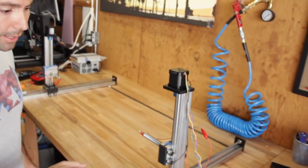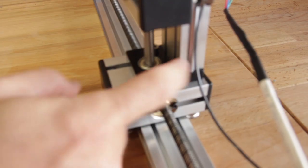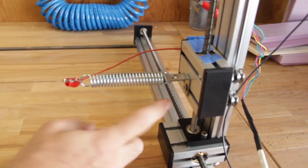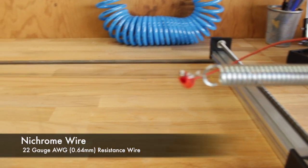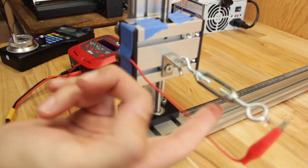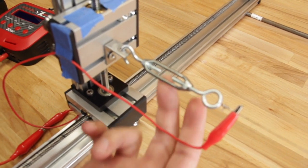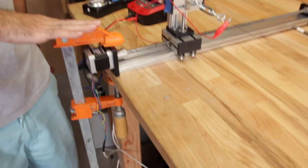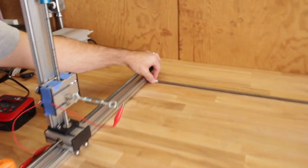All four of these cost me around 300 to 310 dollars — pretty nice, they're not perfect but they do a great job for cutting foam. I basically just drilled them, put a screw in there, and patched it to some bolts below. I got a clamp at Home Depot, a big spring, and some nichrome wire ran across the tube. On this side you'll see a tensioner that lets me tighten and loosen the wire as I see fit. It's a bit makeshift — clamped down with C clamps, and in the back I put a rod to hold it so it wouldn't move.